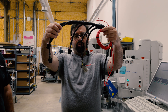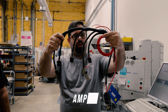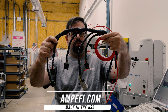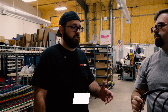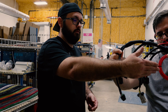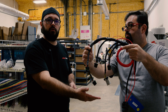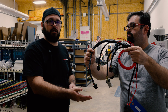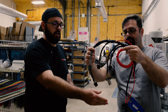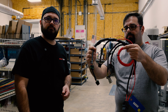After producing some wires and hard work, you get one of these beautiful made-in-the-USA, high quality wiring harnesses ready to buy on our website. The kit includes a relay and some larger gauge wire because the IGN-1As are hungry — when you start making power and turning the dwell up on these coils, they want plenty of current. Factory wiring is not adequate, especially in a race application, so we feed them all the juice they need.